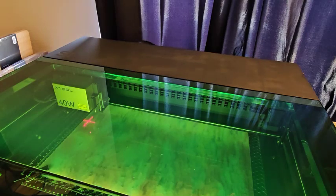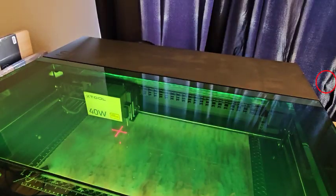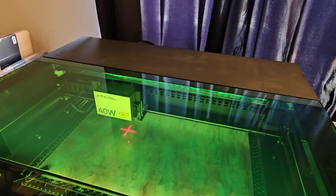So here's what we have now. We can choose a material — I have some acrylic in there, fancy colored acrylic. I'll choose three millimeter black acrylic to start with. Once I load an image, it will allow me to manually change those settings. Next thing I do in the software is auto measure. I'll click on auto measure. It just took that silver needle and touched it to the material, and now it's over there touching it to a ledge that it knows the measurement of. It can use the difference between those two to automatically put the distance in, which is 0.555. I believe I have this in inches right now — I usually switch it to millimeters.